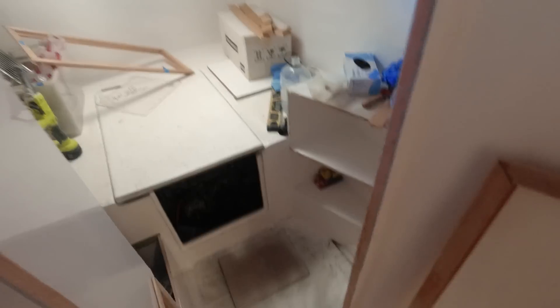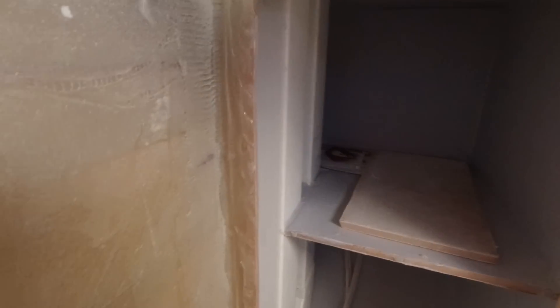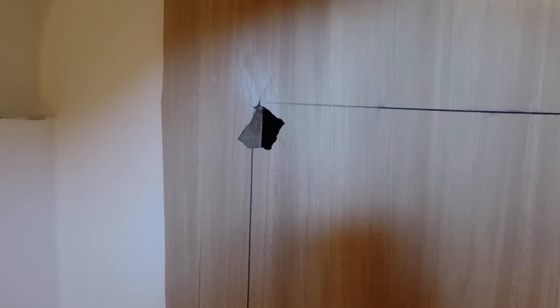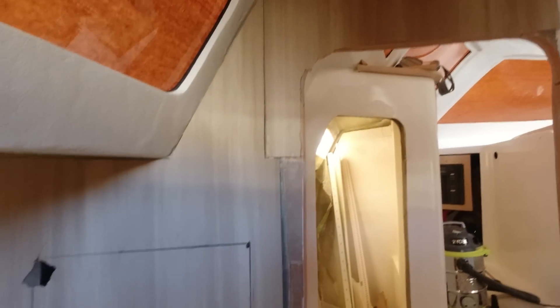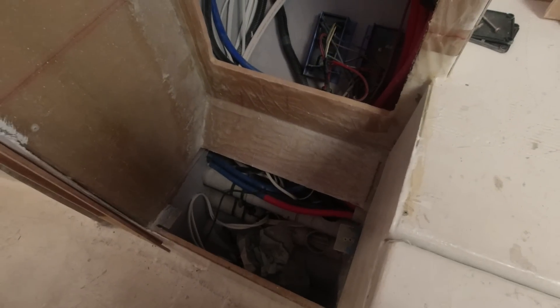In the stern port cabin I've been going pretty hard. I've just lathered up this electrical cupboard with plenty of epoxy — there's not quite enough space here to get it neatly on. I've already done this road here; there's a big hole that's a bit of a mistake but it'll be covered by the trim. There's a bit of a different level in this area where there's a gap in the foam — I'll put a piece of bead in there. The door jamb is going to come right over that, and down here is our wiring conduit area.